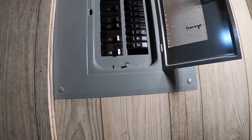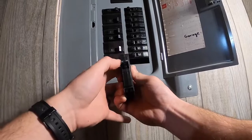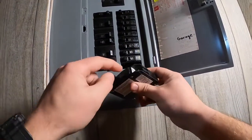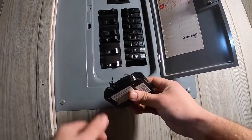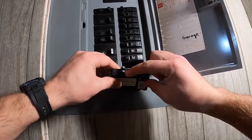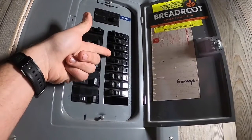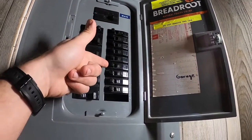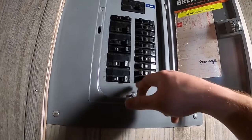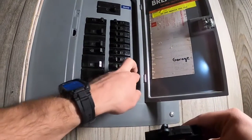For our material that will give us more room on our panel, that's what's called a tandem breaker. This takes the place of one breaker but it has two spots where you can land two different circuits. The only thing you want to look out for is these are two 20s — you want to look for breakers that have 20s marked on them, because some will have 15s, which are most likely lighting circuits, and 20s will be your outlet circuits. There's already a space right here in the panel, and one of these will clear up one spot, so I'll have two spots open.